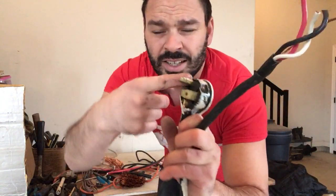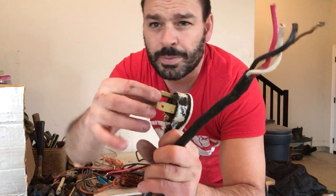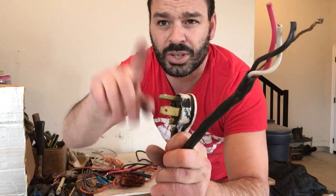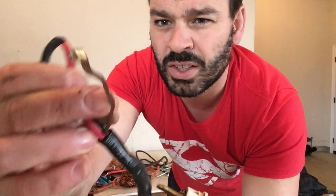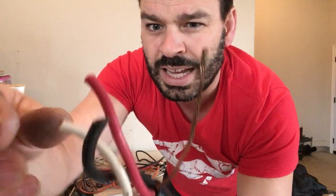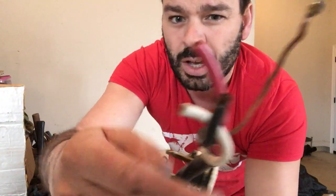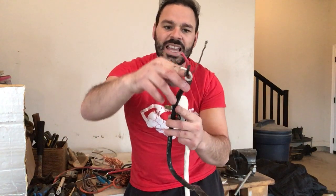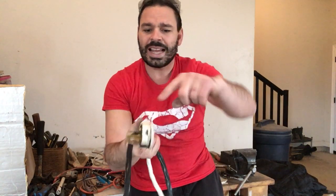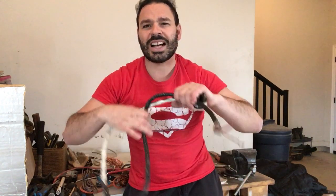The brass, I take an angle cutter or a grinder cutter blade, and I will cut those off and put those into my clean brass, because currently clean brass is $1.95 a pound Canadian. But inside, as you can see, there is one strand of thick copper and 3 strands of copper wire, okay? Because even though this is heavy, because it has a heavy exterior shell and this big heavy head on it, it's going to be classified as the lower copper recovery.